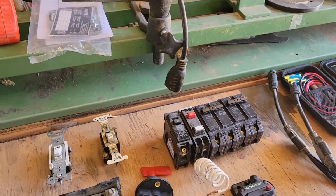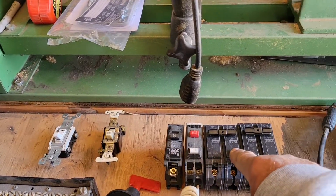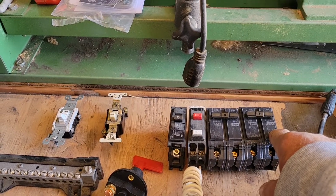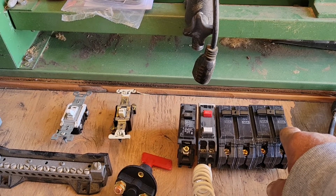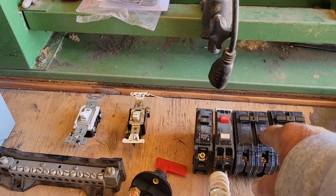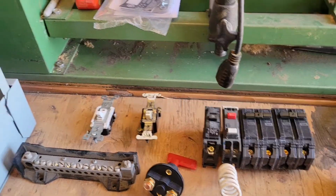Okay, so for your house, stay clear of that. You're going to be working with 15s and 20s. Now you'll get your 30s, 40s, and 50 amps and even higher when you're using 240 volts. And those will come in with your air conditioners, electric ovens and ranges, things like that. So you're going to be using 240 volts, 30 amps. You're going to be using 10 gauge wire to run to those items. So yeah, that's where those come in.